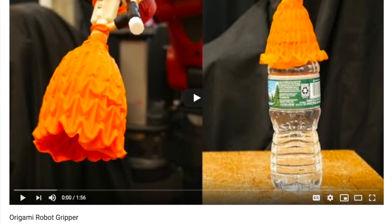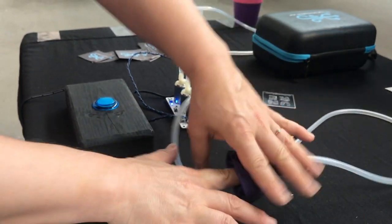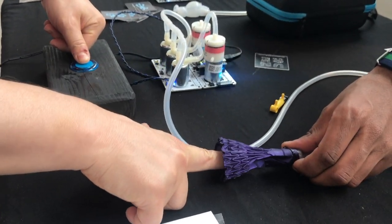The Origami Gripper. The Origami Gripper came out of MIT CSAIL earlier this year in March, and I'd been wanting to make one since forever. Randomly at ITP Camp, I ran across this person who was folding some origami. Turns out it was Aditya Bhatt, who's an expert at origami and has designed many original works. I asked if he wanted to collaborate, and 48 hours later we had a functioning prototype — a 2-gram gripper that can lift a 1-kilo Coke bottle.